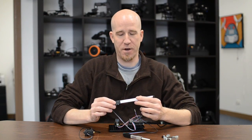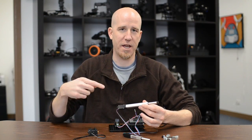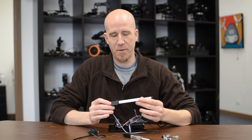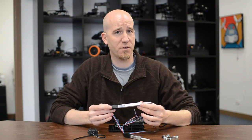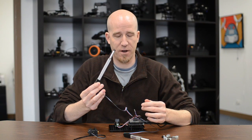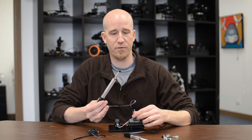So what is a linear actuator? It's an actuator like a hobby servo, except instead of doing rotational movement it does linear movement in and out. These are great because they can be controlled just like a hobby servo that uses a PWM input, because these have controllers integrated into them. So you just plug them right into your shield and control them from code using your servo library.